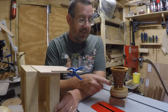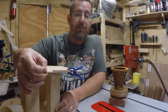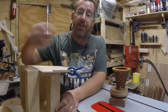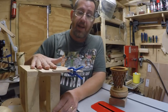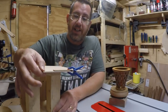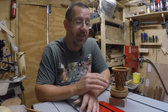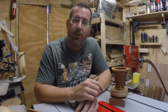The very first ring I did, the gaps were so small that when I got to put the last piece of wood on, this was just too thick. I then had to use a steel rule to just rest my piece on and push it in place. But when I got to each of the rings above, the gap was enough that the work wouldn't hit the bottom when I put the final piece on, and it worked absolutely brilliantly. The best option there would be to have some form of a metal plate, maybe only one millimetre thick. The main thing is you just do not want too much play — it's a very quick and easy clamp for the ring and it works absolutely brilliantly. I have really thoroughly enjoyed this, and hopefully there will be several more similar projects to follow. Thanks a lot for watching, and I'll see you on the next project video.